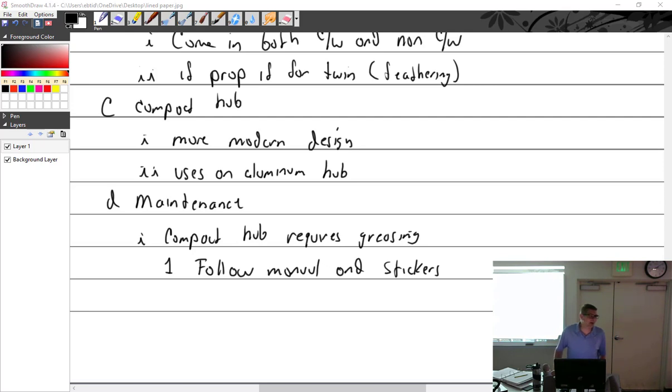I'll wait until I come back and then tape off the aircraft or the cowling comes off, and then I'll sand the whole prop and do a whole nicer job. So it kind of depends on what needs to be done. But if it's a nice prop that doesn't need paint but has one little nick, I would just blend that out and then paint it, and put a lot of paint on, because that one's not lighter. Right?